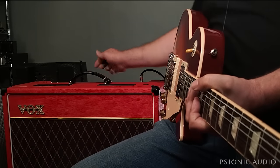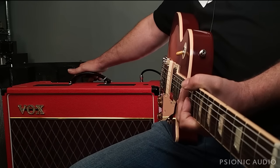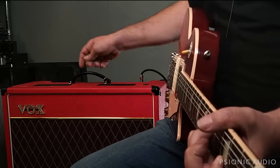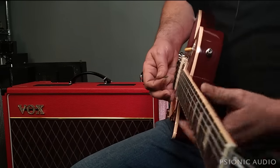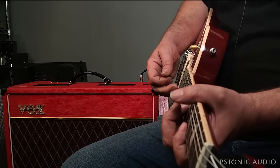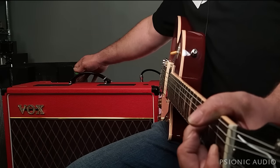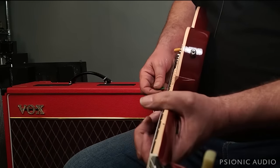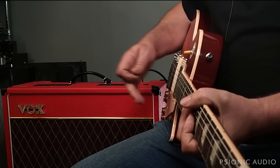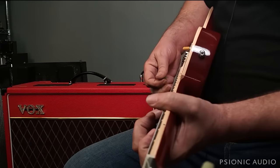That's with the master on 10. It has a good master volume, pretty good. It's a crossover line from about 10 o'clock up. It's pretty good. You turn it way down. I've got it at like 8:30 now. The phase inverter cleans up and the output tube cleans up too much. But starting pretty much about 10 o'clock, it will be your friend. It can be improved, but it doesn't suck in stock form.